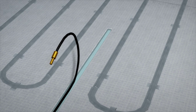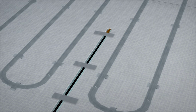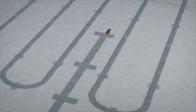If the probe or the power cable sit proud of the subfloor, you may wish to chisel out short channels in the subfloor. Position the floor probe evenly between two of the heating elements, making sure not to cross the heating wire. Tape down the floor sensor at least 300 mm into the heated area.